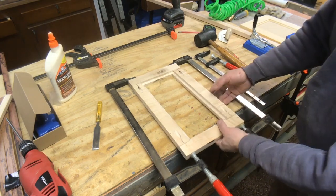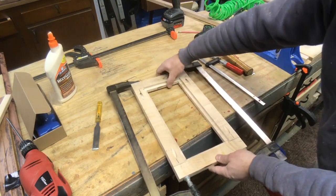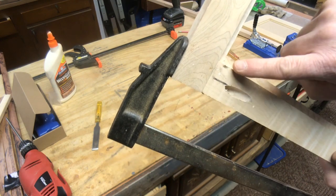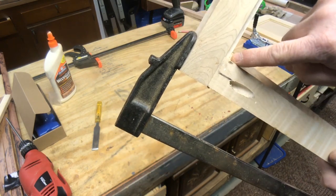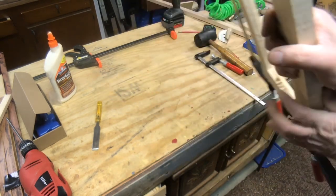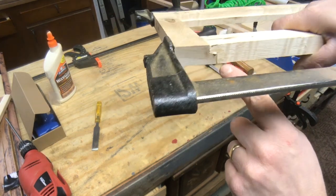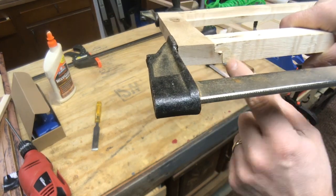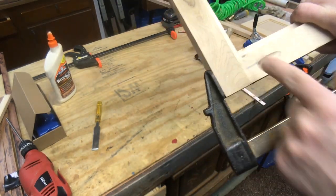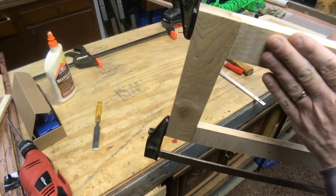And I had to cut away part of the dado on one part here, so the doors would go flush on the front with each other. So you can see this one here we cut away. Hopefully that makes sense. The next one I build, I'll show it a little bit more close up. But if you look on the edge here, you can see, hopefully, what we did. So this one here, we cut away like this so it overlaps, gives us our channel all the way around here without looking at it through here, but still gives us a flat front on the surface.